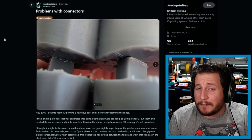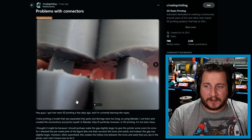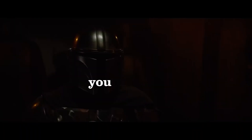Now, this being a resin print, it is a pretty easy fix. The first thing to do is sand both the mating surfaces — the flat surfaces that will meet together — so they're nice and smooth. We can see some cupping in the resin, which means the part should have been printed at more of an angle. With resin, you always want to reduce your cross-sectional area. Less cross-sectional area means less peel forces on the build plate and the vat, which makes your parts more dimensionally accurate. Yes, that means you will have to remove more support — too bad you chose resin printing. This is the way.